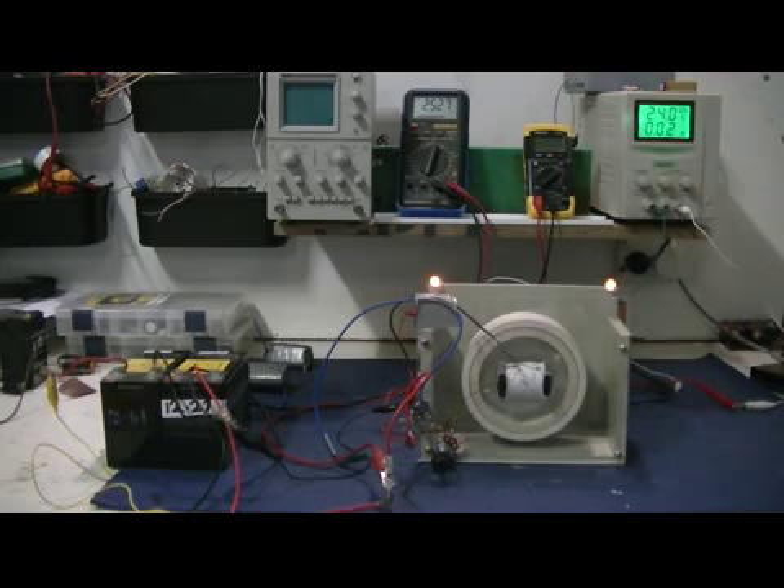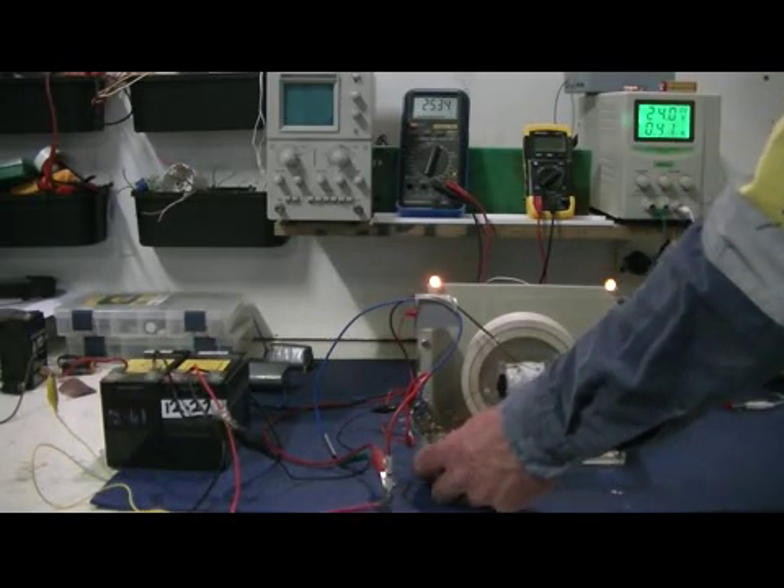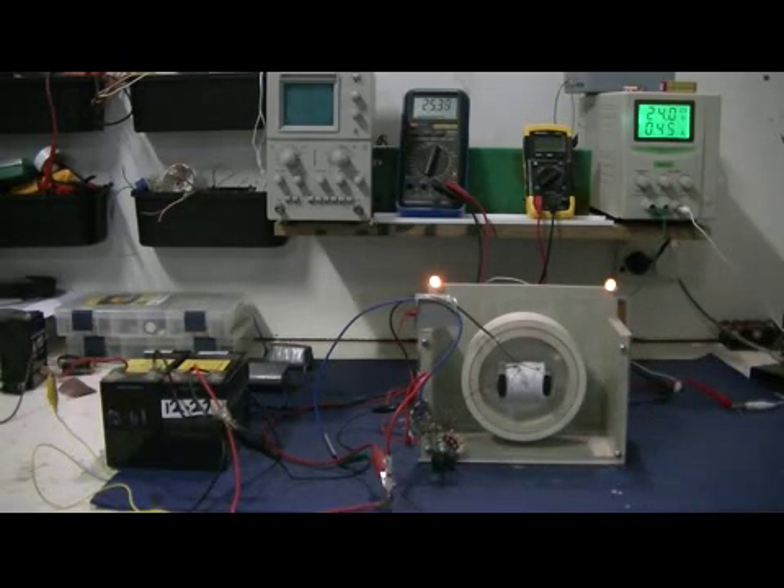The charge of the battery is really good. Really good to bring those two batteries up at a reasonable rate like that — pretty good for, let's say, 30 milliamps, could be 29. We'll give her a kick now because this thing moves out quite well. It starts to shake a bit — this is not quite balanced. The rotor's just a PVC cap with a bit of pipe inside; drew the hole in the back and stuck the shaft in it. But if you open her right up, she really starts to charge the batteries quite well. But of course, now we're drawing about 680, 690, 700 milliamps.